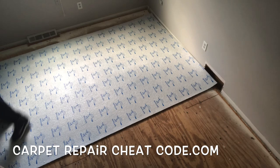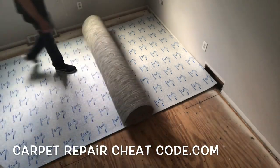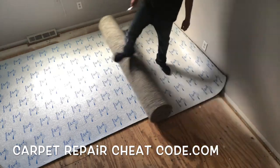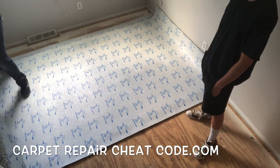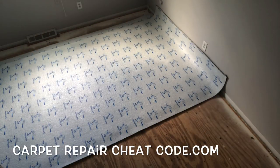We have the room prepped, empty, and ready to rock. We have spill block padding — the kind of padding really doesn't matter, that's just what we're using in this video. We're going to unroll two shots side by side, and when we hit that other wall we'll lob it off, straighten it out, and staple it into place. When setting up the padding there are a few options: you could tape it down, staple it down, glue it down, or just wing it — but it's going to move when you unroll the carpet, so let's not do that.